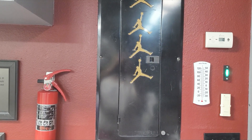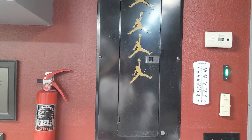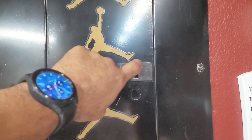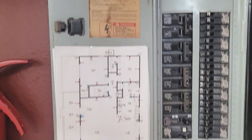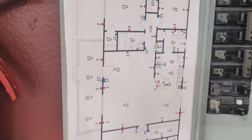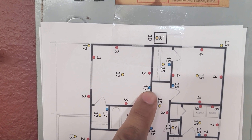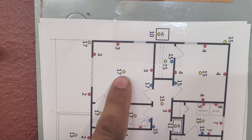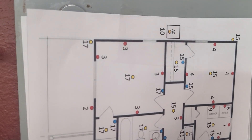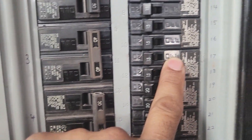Now, it will take a little time to make this, but trust me, once it's done, every time an electrical job comes up, you'll have no problem turning off the right breaker. Look at this — when you open the electrical panel door, it's right there: a layout of the house that shows every outlet number, every switch number, and every light number to its proper breaker. So say I'm going to replace the light fixture in this bedroom with a ceiling fan — I can easily see it's the number 17 breaker. It gets no easier than that, folks.